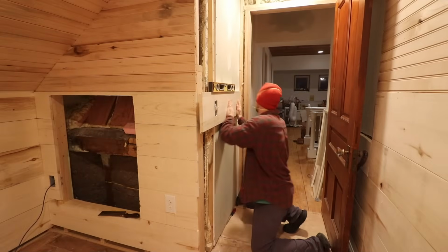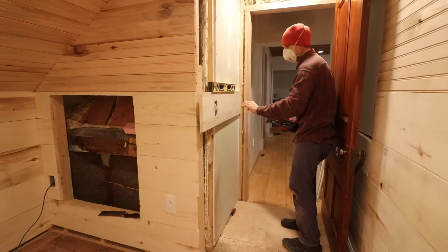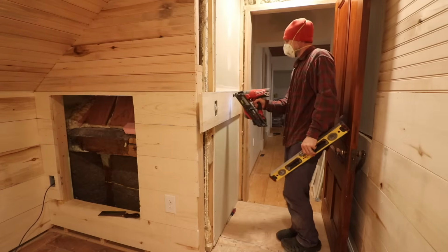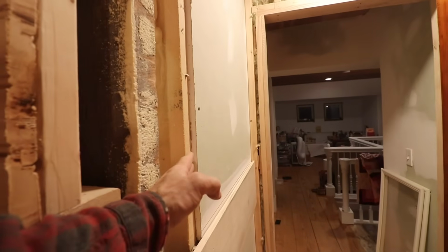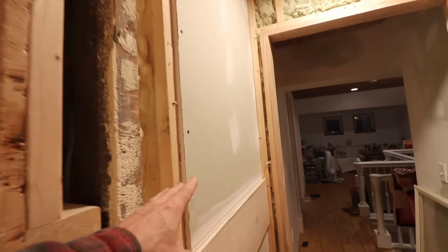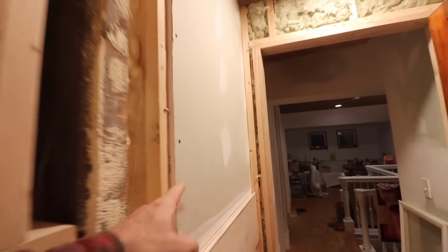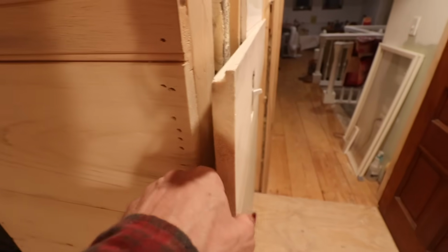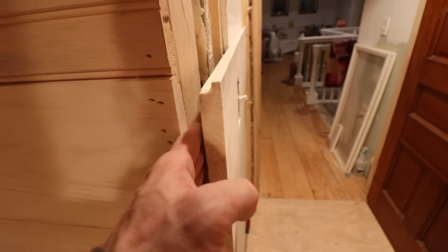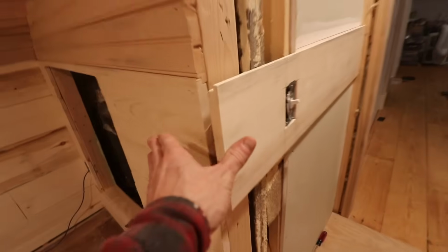What I'm babbling to myself here is kind of just how when I went to connect the stone side of the house with the non-stone side of the house, I didn't really know what I was getting myself into trying to make those connections. This old stud was always kind of a problem. The way I framed this hallway before I broke into the room that we're in now, I didn't know about this stud. This is my other wall that I framed, that's plumb. This is plumb. This is not plumb. So then I've got this board now running straight. I'm just going to have to put some wood in here wherever it needs to be, but this is pretty rigid. That seemed to be the best way that I could make this all flat and straight. And then the trim will cover it.